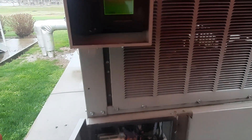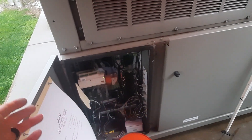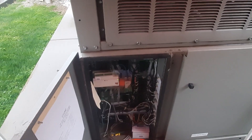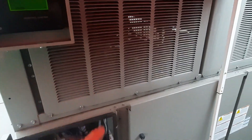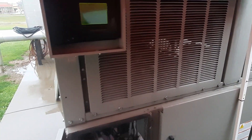We are running and looking good. This was actually not a service call — I'm out on a PM, and they didn't know they had a problem. Nobody had seen the alarm yet, but they did have an alarm on the BAS. Stage two takes over and with no load and it's 50 degrees outside, everything works fine. It is something I do on these PMs, especially now that I know sensor failure is an issue — I always go through and verify my sensors.